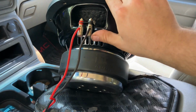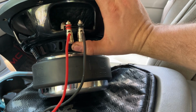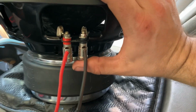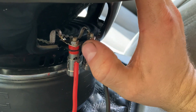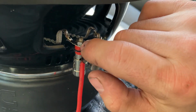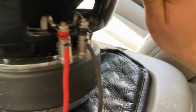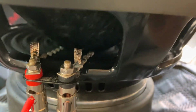All right, so last night I got a phone call, and then I decided to kind of clean up. It's getting cold out. I ended up taking this inside and finishing this thing up, reusing the little terminals for the leads so I can bolt those on. I just desoldered the DC ones, added some solder, put them through the hole, resoldered them, and then I did have to trim up the cone a decent amount down in there.